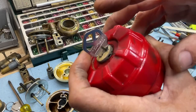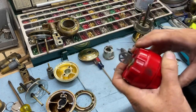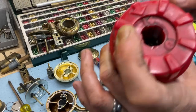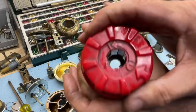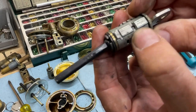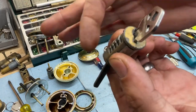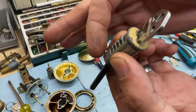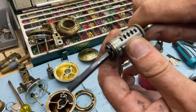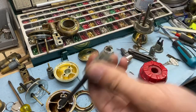If you let it go it kind of spins — always make sure it's held. That's actually dangerous, never let it go like that. Push it in until you hear or feel a click — that was a loud one. Push the key all the way in. We're still holding it at this notch. Push it out the back. Then turn this back to the ready position. Locate the little notch — that's where the sidebar will be. Always hold it right there.